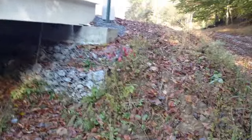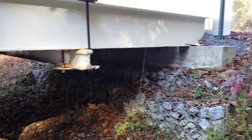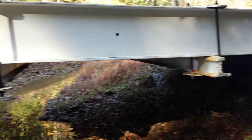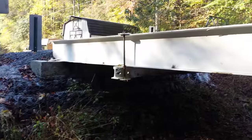What we've done here on the abutments — instead of pouring solid walls, we used gabion baskets for the abutments. Then, as you can see, we poured a cap with reinforced concrete on top for the beams to set on. Very inexpensive and works well with low volume traffic.